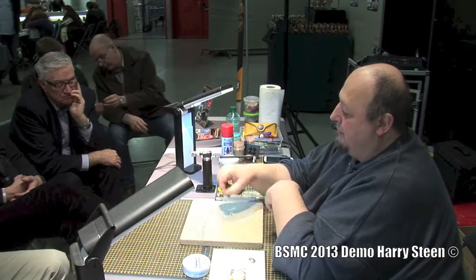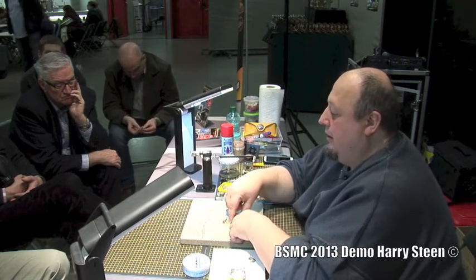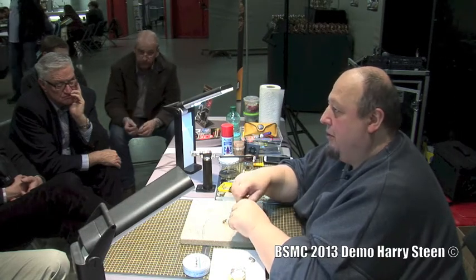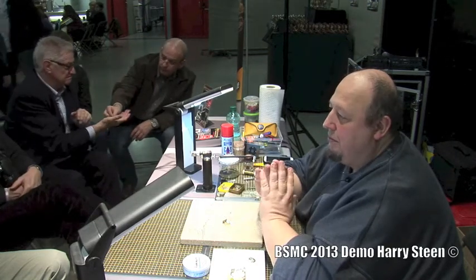So you have to ensure the fit is right. And also same as with super glue: once you are soldering, you may not move it. Moving parts or parts that are not stable will not solder. Because at the moment the solder is getting cold enough to stabilize and there is movement, it does not touch anymore and it is gone.